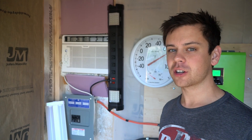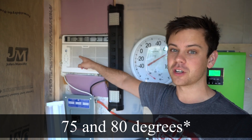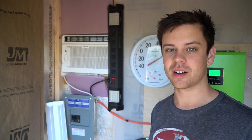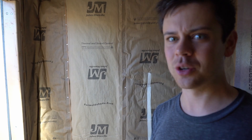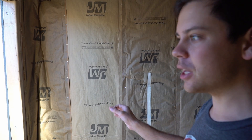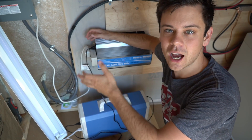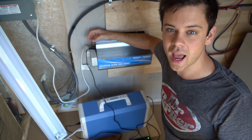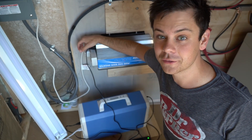Today we're going to figure out how much energy is required to keep my solar shed at 75 degrees Fahrenheit on a 90-degree day. I insulated all of the walls but not the roof, and I'm not sure I need to — in the last week with 80 to 90-degree days it only used about 5 kilowatt-hours for the whole week. We're going to use a kilowatt meter for the AC output consumption, then add inverter efficiency. I'm going to reset this meter and come back in 24 hours.